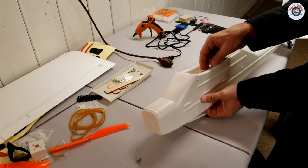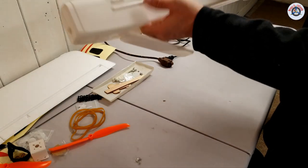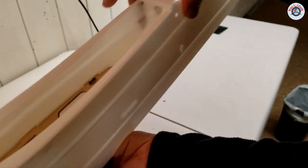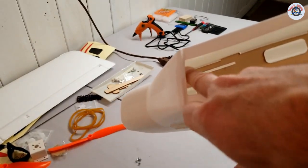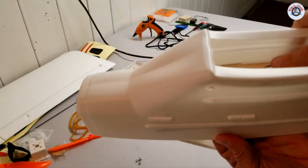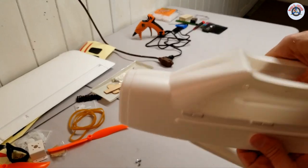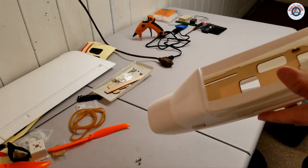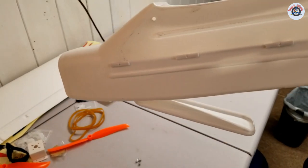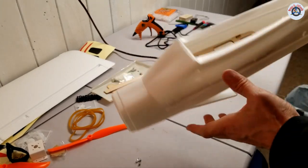And to get it inside, it's a little tricky because you have to push it that way. And then the front section is a little tight. So what you have to do is put your fingers through the bottom opening and help it that way. It will help if you get one side in. So there are three slots, if you can see them over here: the first one, the middle one, and then the front one. So once you get those tabs into the slots on one side, in this case on the right side, I'm opening up the front section of the plane and then pushing everything in, and now they are seated. All the tabs are seated in their associated locations, as you can see if I hold it towards the light: the tray is now sitting here with the tabs. And we are going to need six screws.